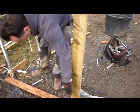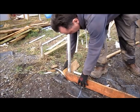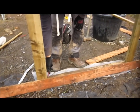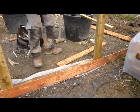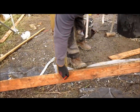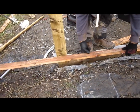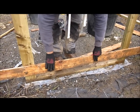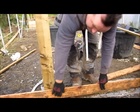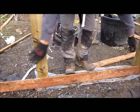We're going to bring this timber straight across the door here. Just offer them up so you know that's going to be like that with the timber that goes this way. And then just mark two little marks here — you'll see why. We're just going to cut down here now, one inch, and one inch down here. The reason being that this will be flipped over later, and our timber will be up here, and then we'll be forcing them down. When you cut from here, you won't have to cut all the way down and damage your saw. Just work out where your cut will need to be before you put your whole frame together.